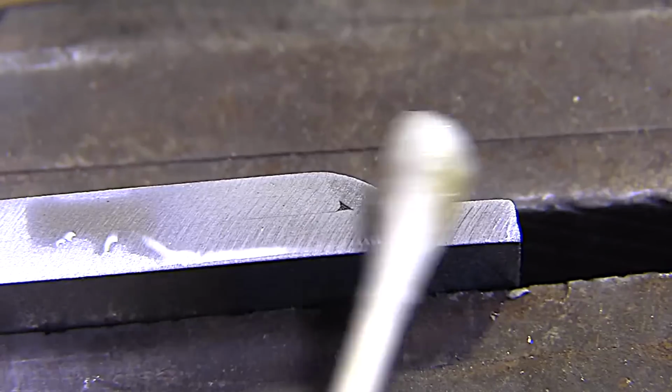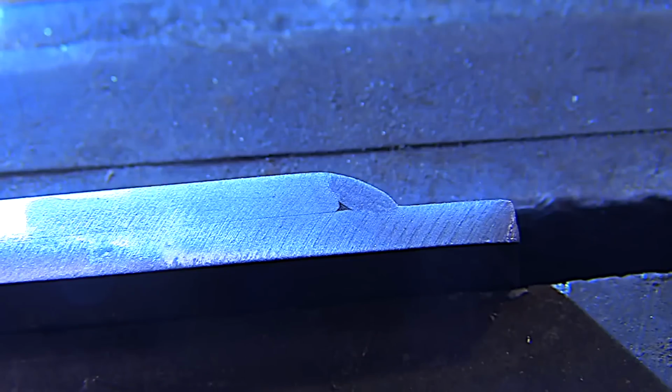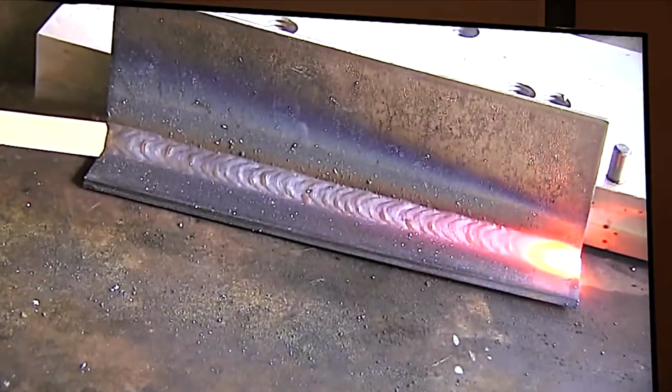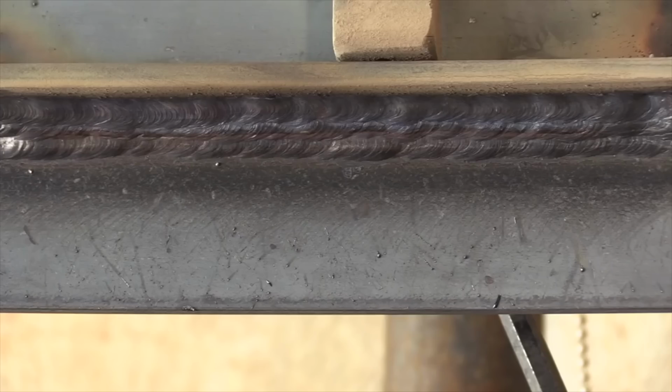This is where cut and etch testing is worth its weight in gold. One test is worth 1,000 opinions. That one got some lack of fusion. That dog won't hunt. Carbon steel is relatively easy to etch. It's really handy. You can test things like pushing versus pulling on your gun angle. You can test your MIG settings. And if you write some stuff down after you test it, you got a lot of confidence. You know what works. You know what settings will work.